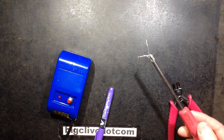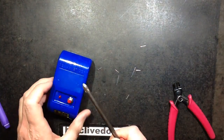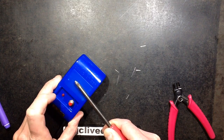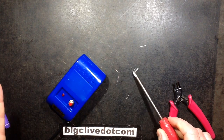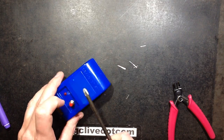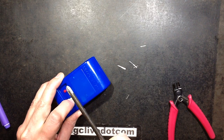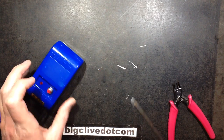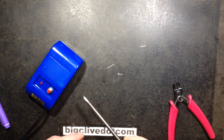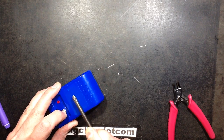If I pick up some leads with this screwdriver and then put them down again, and then hold the screwdriver on to the degausser and press the button - it's going to make a lot of noise. If I just let go of the button there's no saying what its magnetic state is. It's still magnetic because although it was alternating north and south, it didn't taper away. However, if I hold the button in and lift it away slowly, it's quite difficult to do in a controlled manner.